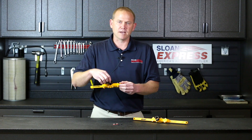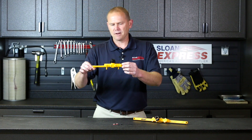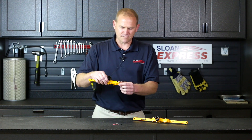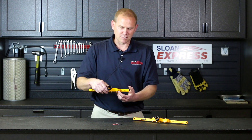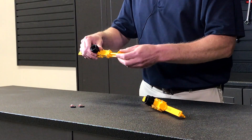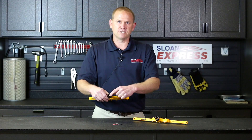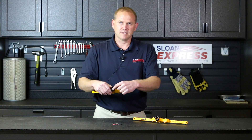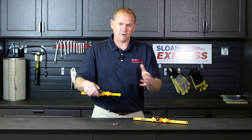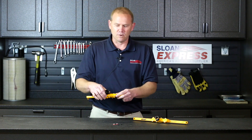The old stream bars used to have an orifice plate you had to pick out and put down in here before it would actually drop down on the ground. What they've done now is they've actually changed it inside to where you can make a selection. You've got a selector across here, one through six. And what that does is it actually changes an orifice inside this body, so all you got to do is go along there and pull every one to that number and you're ready to roll.